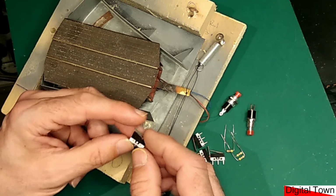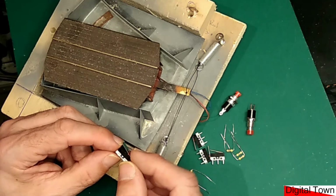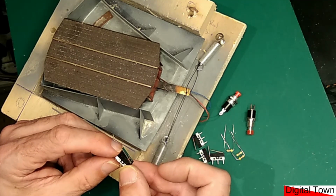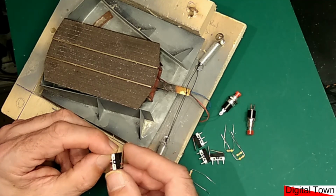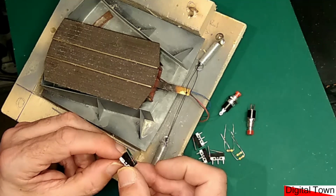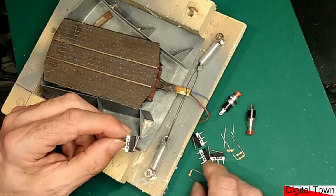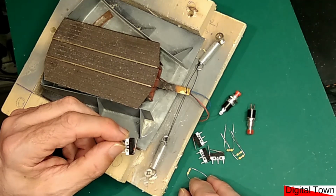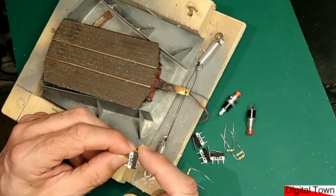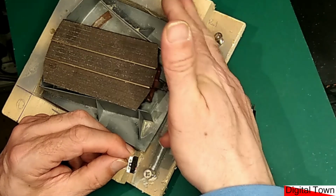Now here is a weird one. If we are using a pull-up resistor, then what we are saying is the default state is that power is running and the switch is switched when the power goes low. Now if you can imagine, if the wire broke and you're using a pull-up resistor, so let's imagine what we're then saying is when the switch gets pressed, the line goes low and then our motor starts to turn.